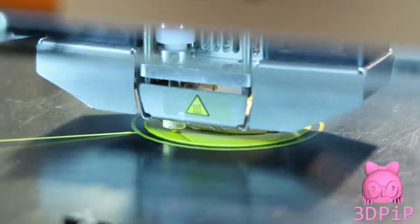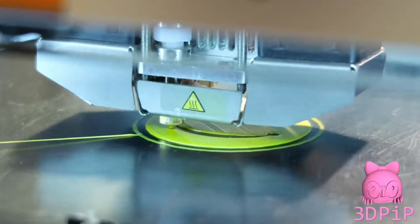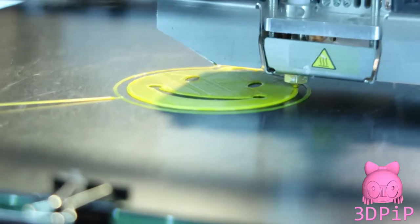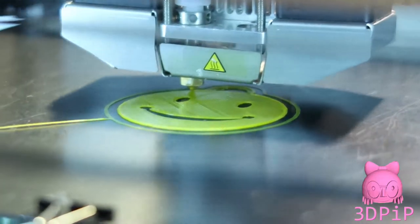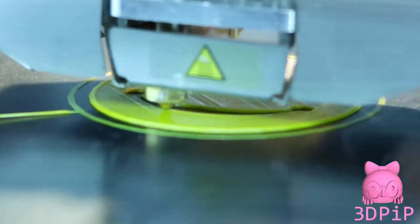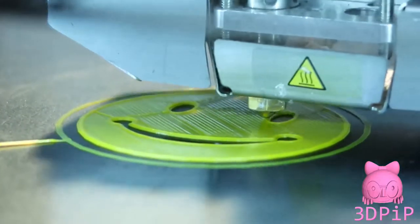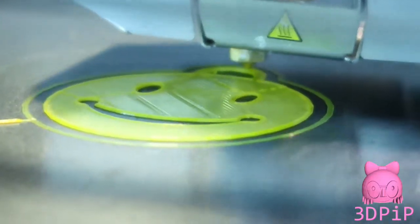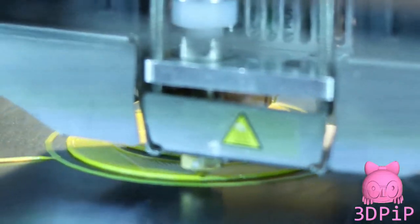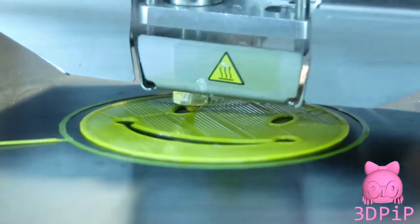So that's why plastics are the right thing for this, all kinds of different plastic, but each plastic has its own melting softness temperature to be pliable enough to be pushed through the extruder, because it gets pushed through. And just molten enough that it actually sticks to the layer below. Because it basically pushes the new layer on top of the old layer into the old layer and heats up the old layer a little bit where it touches, and so it fuses together.